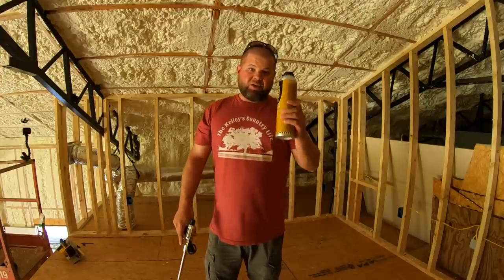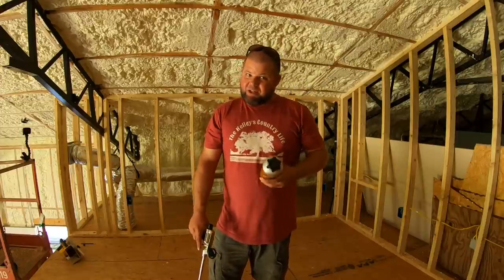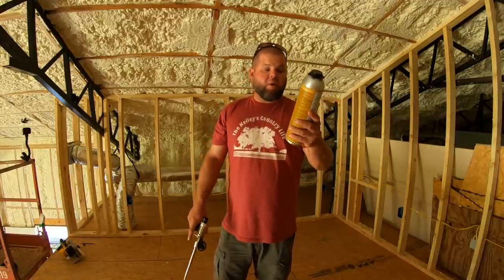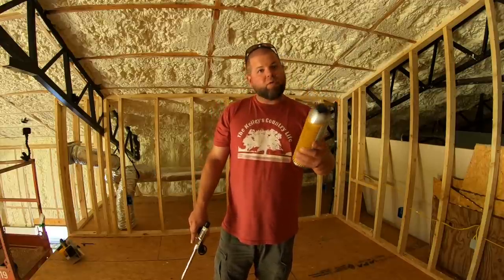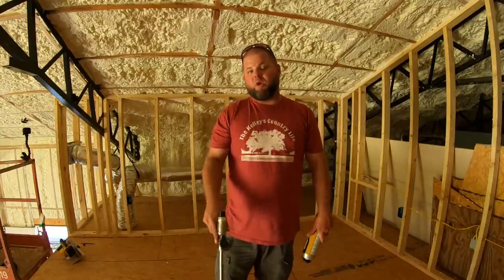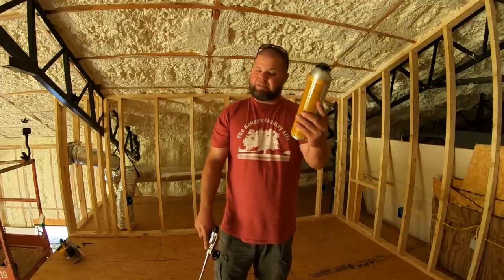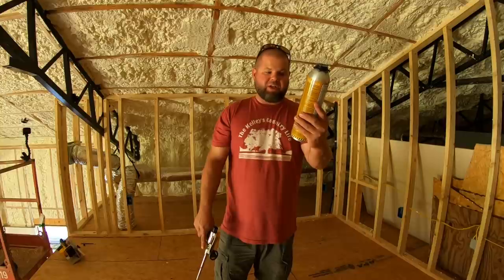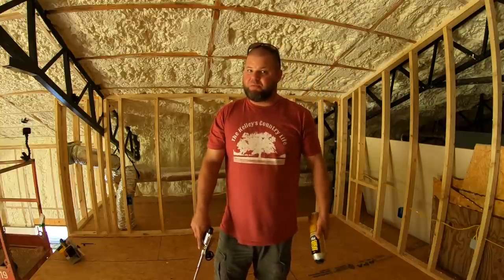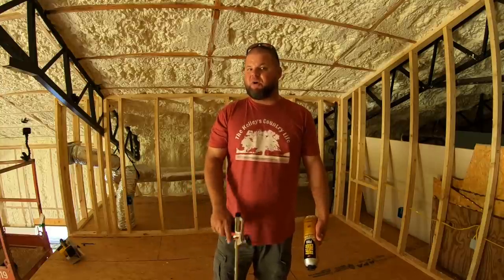It's not cheap. It's a little over $20, but if it meets the claim that it says, it's $20 well spent. And by that, I mean it says it'll do drywall, paneling, subfloors, foam panels. It lists all kinds of stuff. It's made specifically for subfloor adhesive. And this claims that this one can will replace up to 16 tubes, 32-ounce tubes, not the 10-ounce tubes, of traditional subfloor adhesive, like say Liquid Nails and some other brands.